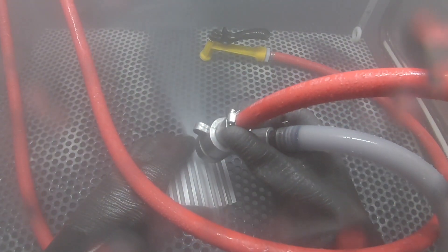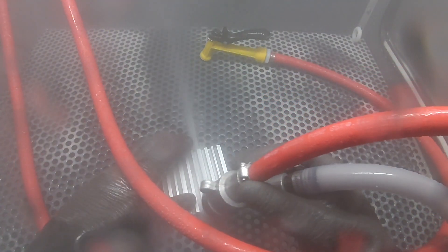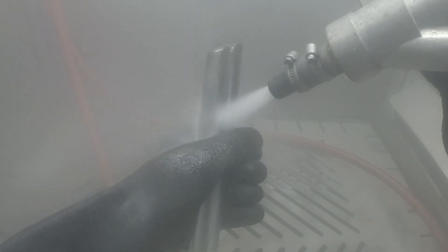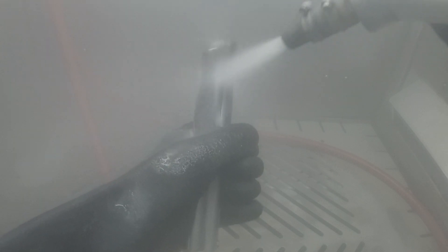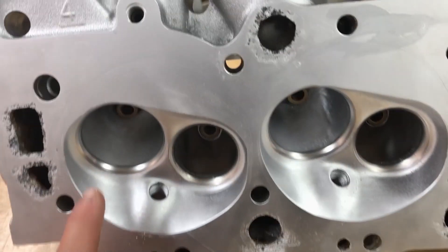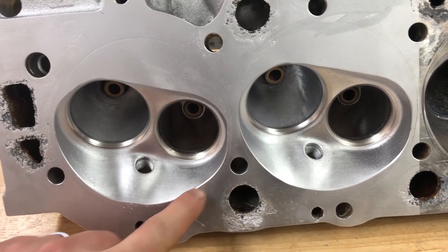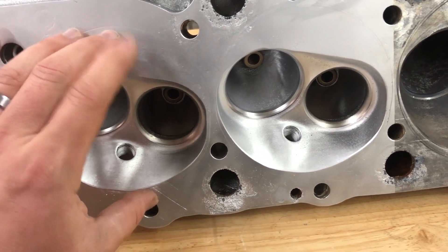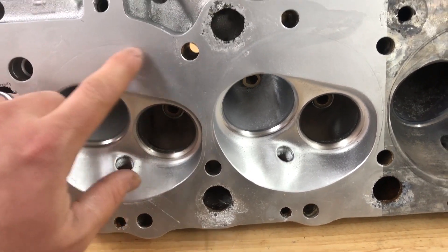You have to wash this part — there has to be a way to scrub and cleanse the part thoroughly. That's where vapor honing comes in. With the abrasive and water combination, the abrasive is gently scrubbing the surface and the water is washing it away — it's like shooting a garden hose at the part. People ask all the time about sealing surfaces: are they going to get damaged? Absolutely not. You can actually see where the cylinder is making contact with this head — we're not eroding that material away.